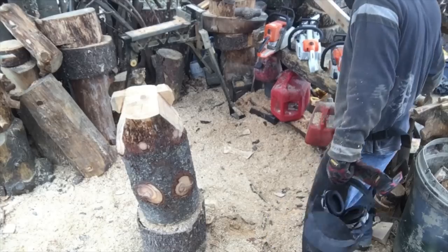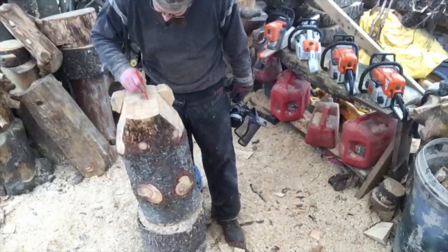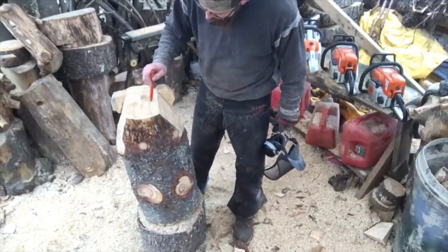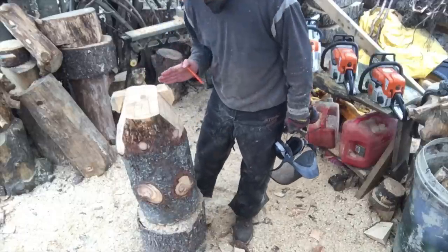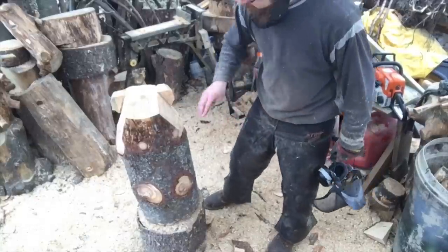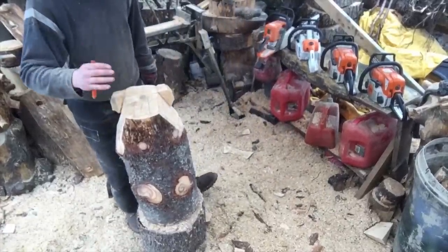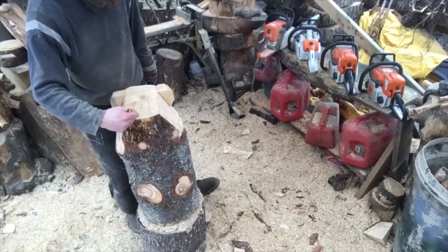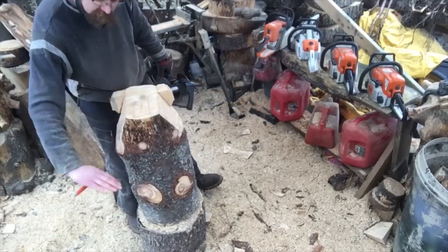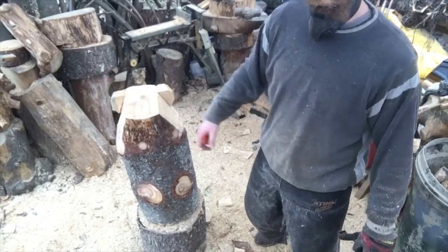Right now we're going to come in here in the front and cut roughly within this area — not exactly on these lines. I'm going to be right here and then get the cheeks and where the eyes are. I'm going to come in with a saw at an angle and curve it down — as you're cutting it curves down and that's going to take this piece out, revealing the front cheek, the eye area, and the side of the snout. And you're going to come over here and do your best to make those same cuts. What I like to do is make this cut first, then come in and do where the cheeks would be — swoop them down. And you'll come back through and clean that stuff up after. So right now let's get this snout cut.